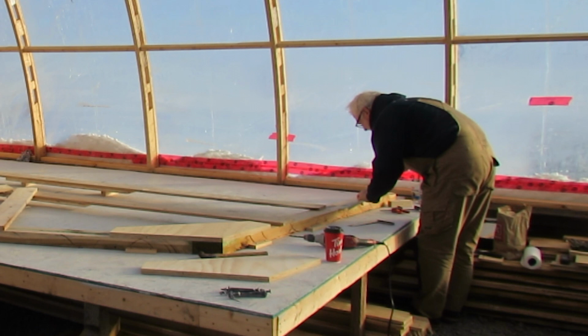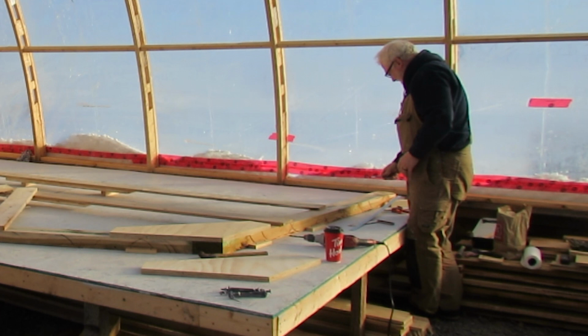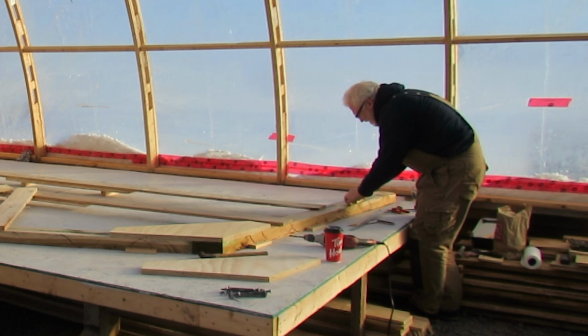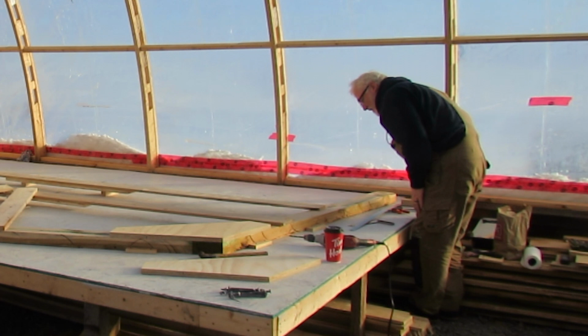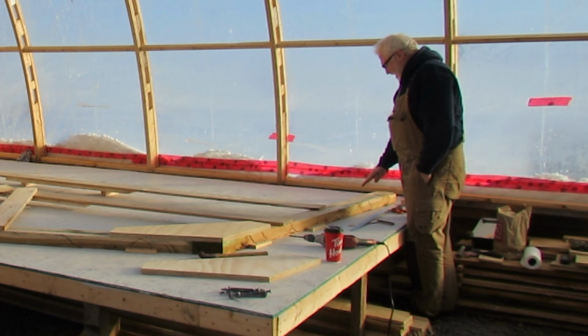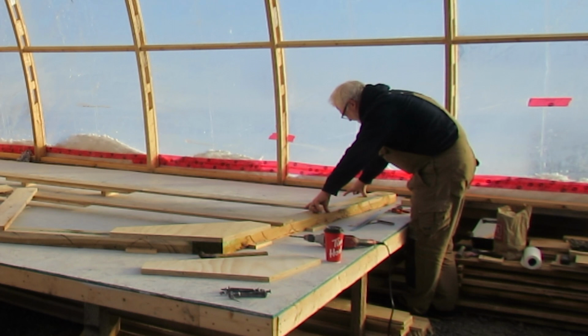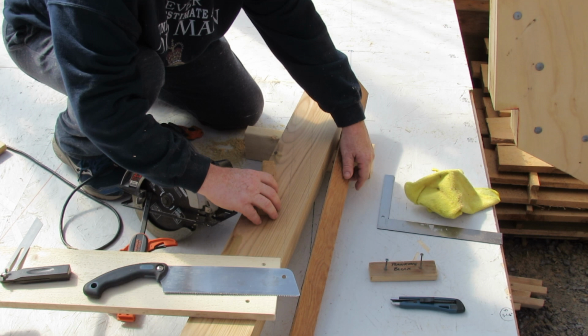There, then I marked the shear and raised shear lines, the outside of the planking, the thickness of the planking, 1 3/4 inches. Just put some marks down, drew that line. So now, this line from the shear here will be the cut line. So later on, I'll cut that, and then, in theory, I should be able to just flip this over, and then this will maintain its 5 inches of thickness. Let's see. I knew I should have listened to Mr. Adolph in grade 10 geometry class.